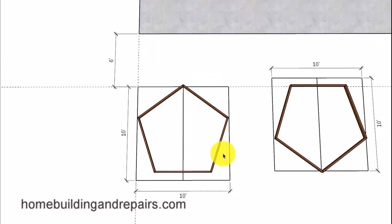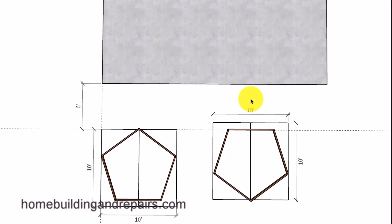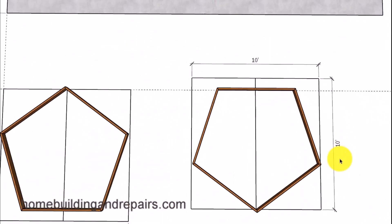This might not be that big of a deal if you're building a flat patio roof on top, but it might be a bigger deal if you're going to have hip rafters coming off of each point. If you wanted to flip it around and have this side over here, you could do the same thing with your center line — simply starting from this side and following the same guidelines. Or you could place your first board here, have it parallel off of the building whatever distance you need, making sure the center of this board lines up with the center line you're using to form your pentagon, and then go backwards with the instructions starting with this board and finishing with this point.